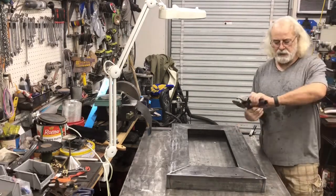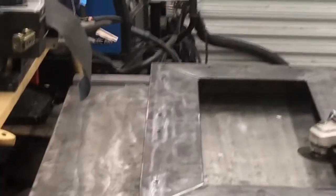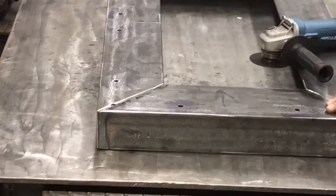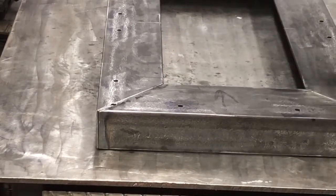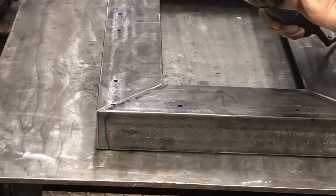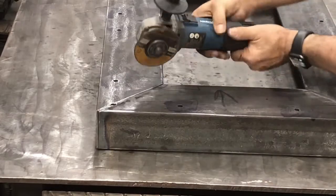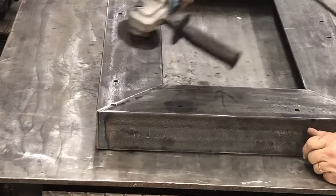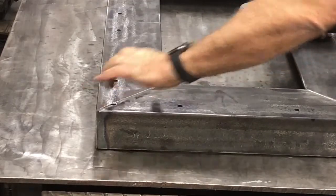So then I took basically an angle grinder. Let me zoom in. I guess I gotta change the orientation now. There you go. So if you see this line here, this is a cutoff wheel that is not much thicker than my fingernail. So basically what I did is hand jobbed it across here and across here to make a very shallow 16th inch V-notch.